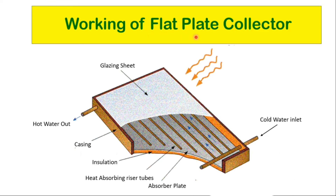The operation of the flat plate collector is based on heat transfer. Solar radiation falls on the heat absorbing plates of the collector. When incident solar radiation hits the absorbing plate, part of its energy is converted into heat. Consequently, the temperature of the solar collector increases. If we pass a fluid inside the collector, the fluid temperature rises because part of the absorbing plate's heat is transferred to the liquid inside the tubes. Generally, the tubes are made of copper. However, some of the energy is still lost as radiation to the outside environment.